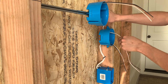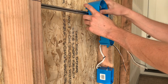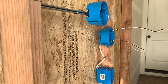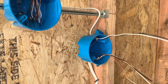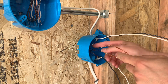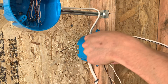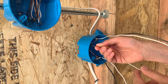Now you've got your two wires inside the box. On the first one you're just going to fold it up — that's all you need to do. On the second one you're going to have to tie the grounds together. You can meet the grounds in the middle, the bottom, or the top — it's really just up to you. I'll just meet them at the top.